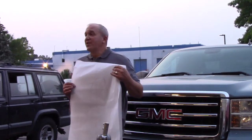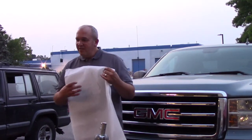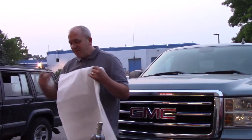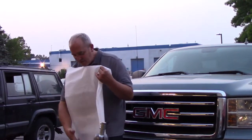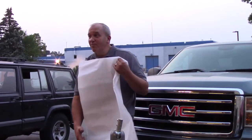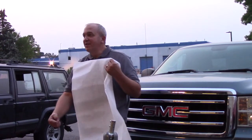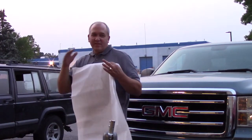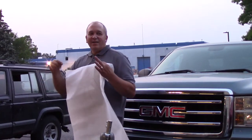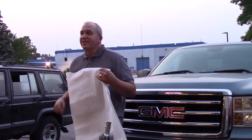So far it's working. I glued the two center ones together, and I cut the profile. And then on my side ones, I transferred where I need those to be and drew a line on my wood, front and back. Then I could draw my side profile on that. So I got that part done. Now I'm gluing them together. And once I get them glued together, then I can cut my top profile out.